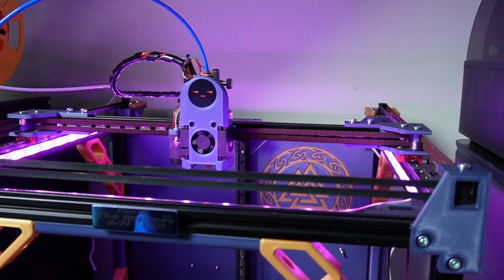I like this printer overall, but I must warn you, if you want to make one of these, it's a lot of work for first timers. So I think the next time I make a printer, it will be much easier because I know what to do and what not to do. It also has a Z-tilt, 3 motors, 2 in front, 1 in the back. The Z-tilt works fine, and before it starts printing, it will always do the Z-tilt to make the bed as flat as possible. And then it will do the bed leveling with the probe system that we also implemented in there. It will bed level the place that it's going to print at.